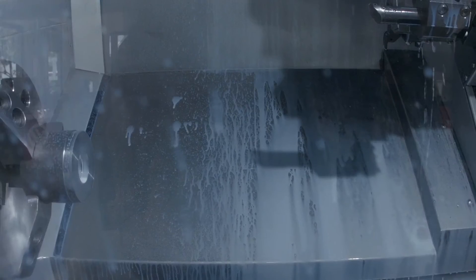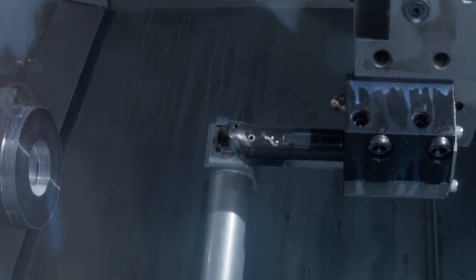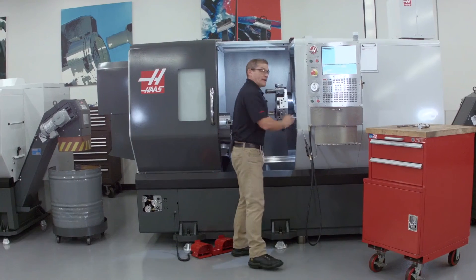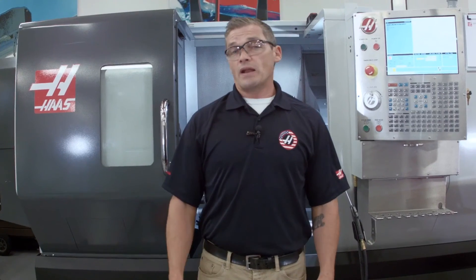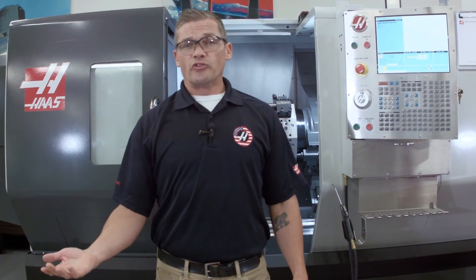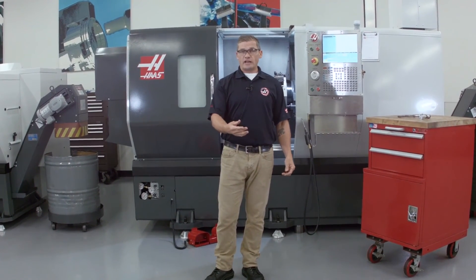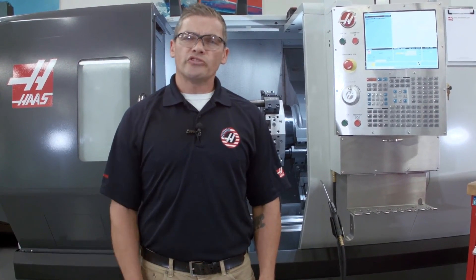Our drilling cycle has just completed, and now, before we move on to the ID boring operation, we're going to check that the boring insert is actually in tolerance. We've checked it — and it stops. That means the insert is actually out of tolerance. Adding that break detect step to our program was really easy, and it saves our part when the cutting edge deteriorates. With the automatic tool presetter, setting your tools for the first time is really easy, and after that it's all automatic. When you need to check for a broken tool, just enter break detect mode, drop the generated code into your program, and you're good to go. With the Haas ATP system, checking your tools is simple. Thanks for watching.